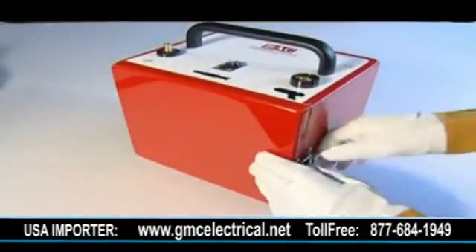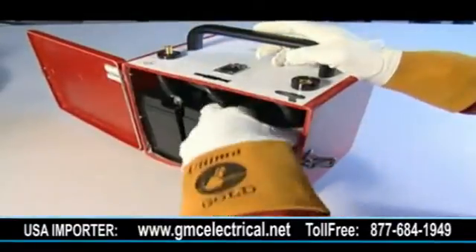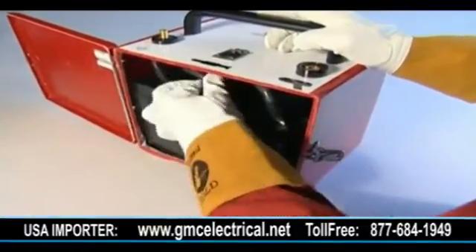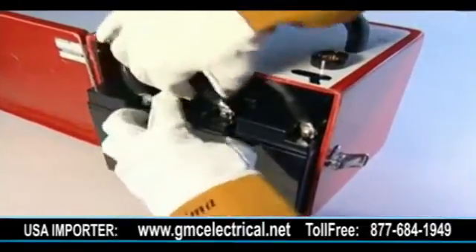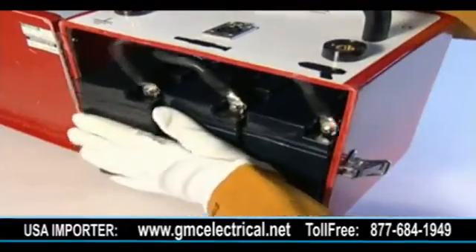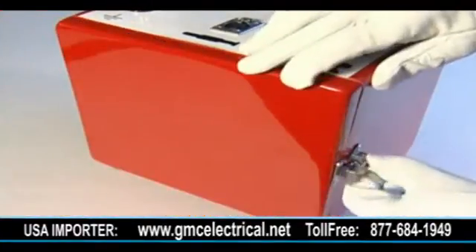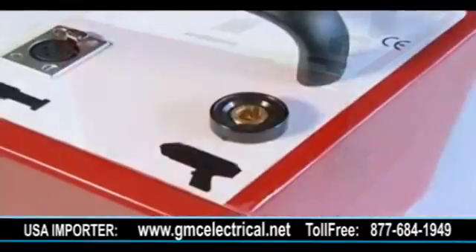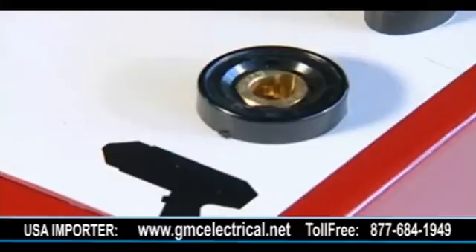A standard pin brazing unit comprises three 12-volt batteries wired in series, creating a 36-volt operating system. Standard batteries are a wet sealed non-spill type and require no maintenance other than regular charging and visual inspection to ensure there are no loose cables, visible damage, swelling, or leaks.